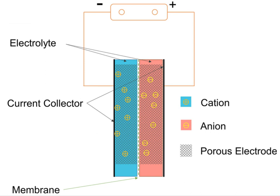Military. Supercapacitors' low internal resistance supports applications that require short-term high currents. Among the earliest uses were motor startup and cold engine starts, particularly with diesels for large engines in tanks and submarines. Supercapacitors buffer the battery, handling short current peaks, reducing cycling and extending battery life.